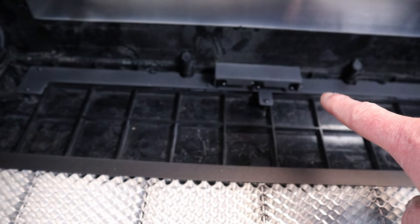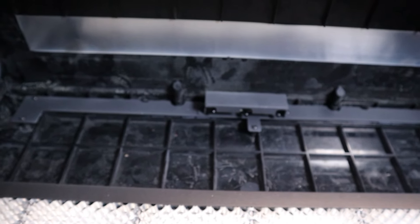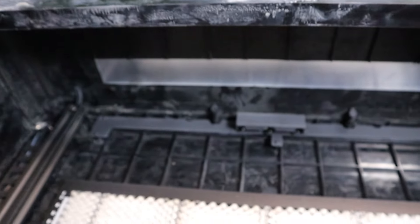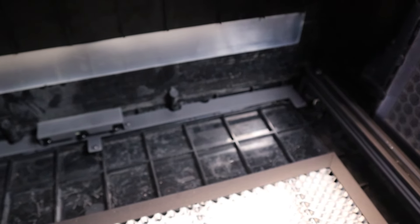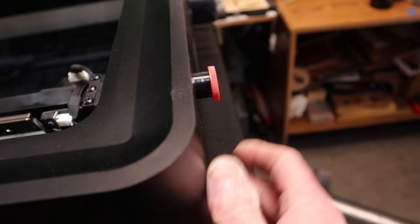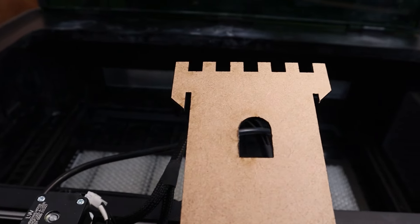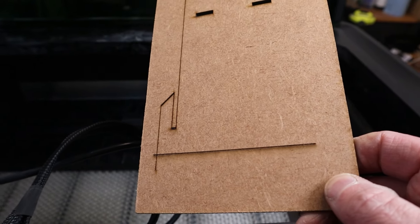The fire sensors back here were triggered way too easily — I'm not exactly sure why. I actually think it's a sensitivity issue that needs to be fixed and adjusted. It took me a long time to do the testing I needed to do because this kept getting tripped and it shouldn't have. I had the air assist on, the fan was running evacuating the smoke, there was no flame — I was doing a simple cut — and it kept kicking off. So I got really familiar with the restart button and restarting things in LightBurn.